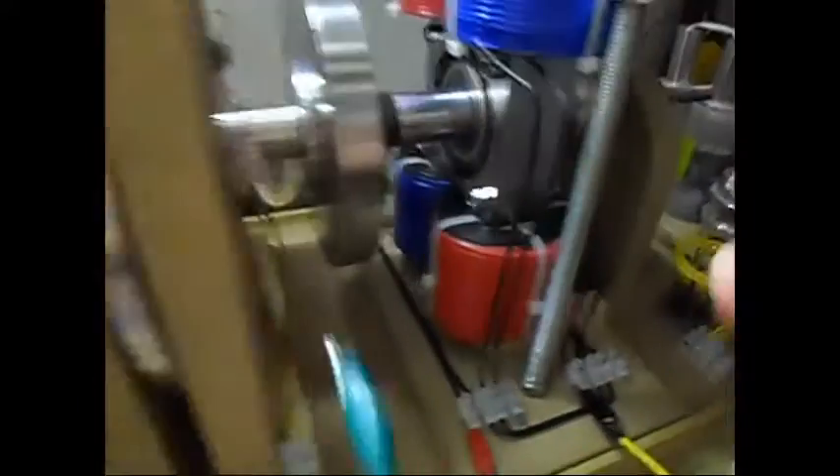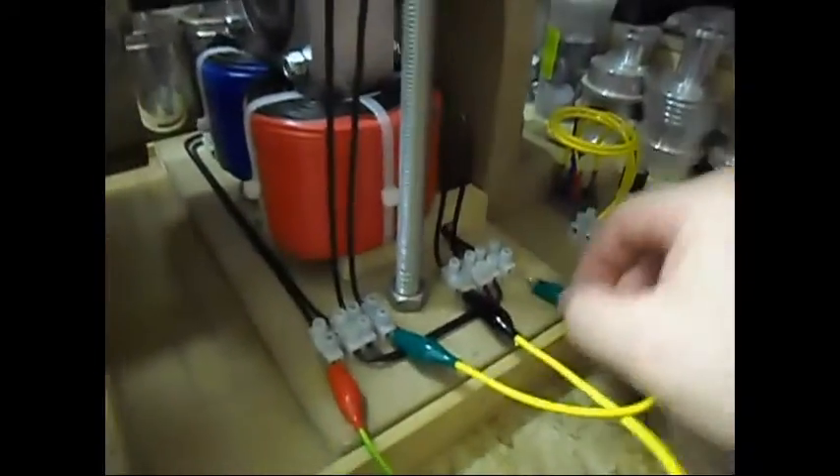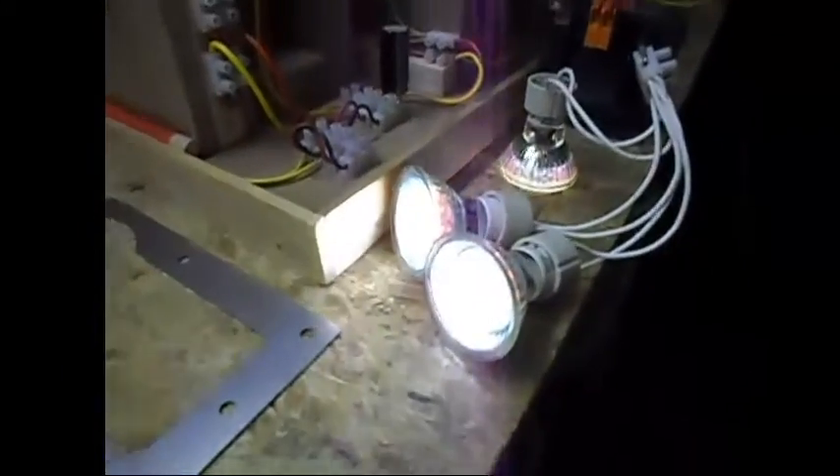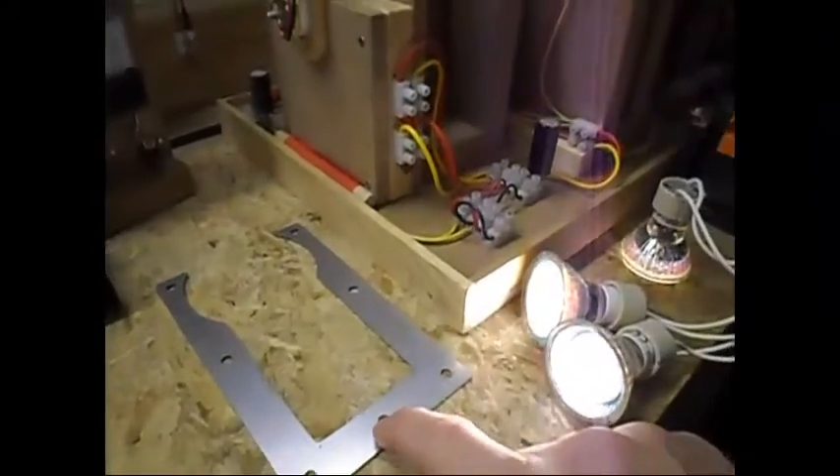What I'm going to do now with this lead is I'm going to short the two top coils. The two coils are also in series. I'm going to short them now — connect the lead there and there. And as you can see, I have now output, just like I had using the U-Core.